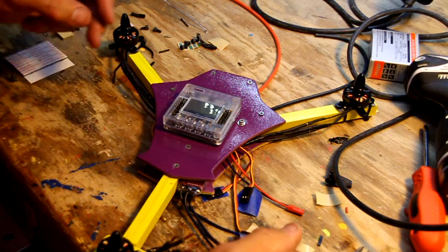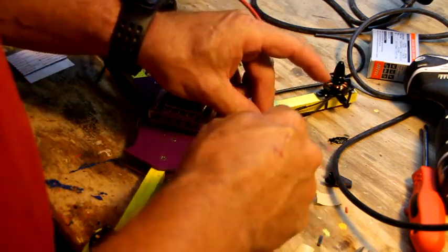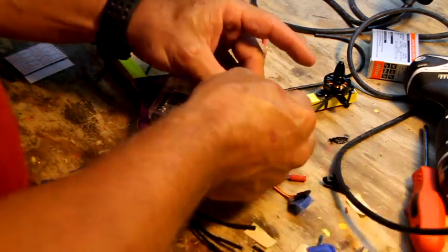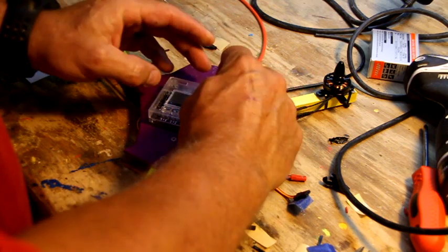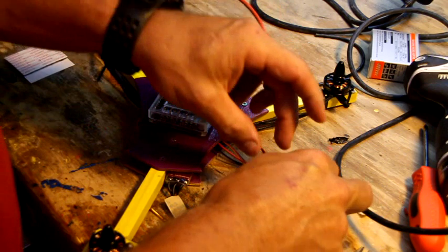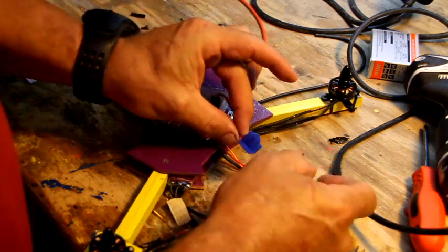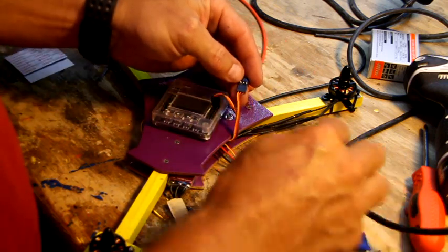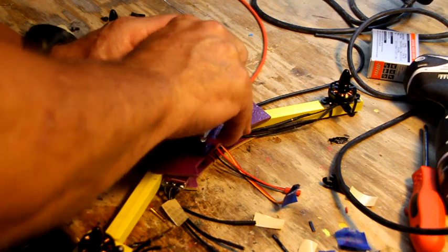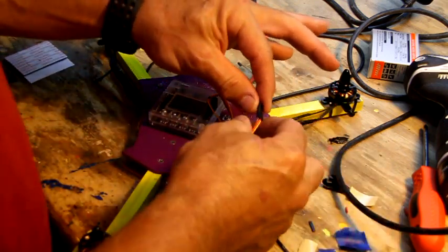And you're done. So we numbered those little speed controllers, and hopefully none of them have fallen off. We're going to take number 1, it's going to the very top, light colored wire to the inside, dark colored wire to the outside. Let me put my glasses on to make sure I hit all these things right. Number 2 goes in the second slot. Number 3 goes in, you guessed it right, the third slot.